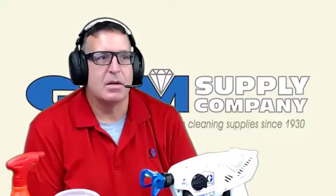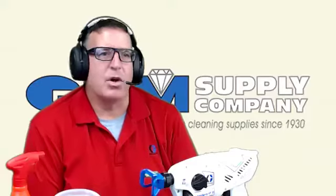Can we go back to the process? Can you hear me? This is Lynn Sprouse with the city school system. Yes, sir, I can hear you. After you prime the machine the first time and then bleed the air out, do you also have to prime it again? No, you don't. If you squeeze the trigger and nothing comes out, then yes. But normally, no. Once the air is out of the bag, you can prime and then just flip over to spray and go.